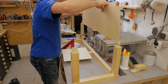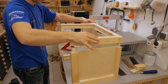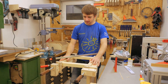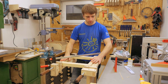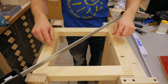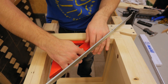I'm also not forgetting to glue in the plywood panels. This upper part didn't come out quite square during the glue-up, and I had to put a clamp diagonally to bring it into square. I made sure that this corner is square and this corner is square, and if those two are square, then the other two should be square as well — but as you can clearly see, they are anything but square.